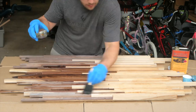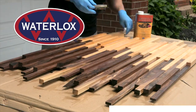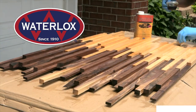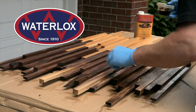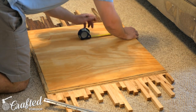With all the strips in place, I gave them a quick sanding and then applied a few coats of Waterlox, another one of this week's sponsors. Waterlox is a blend of tung oil and resins that creates a really tough, water-resistant finish that is also absolutely beautiful. The tung oil penetrates into the wood while the resins remain elastic, and this combination holds up to wear extremely well. Check out the link in the video description to learn more about Waterlox.